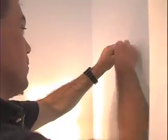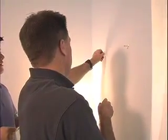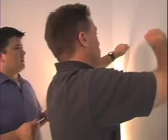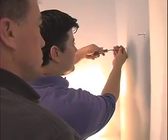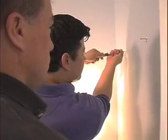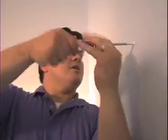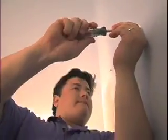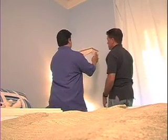The hole your screwdriver just came out of is the hole that'll accept the screws that will go into the wall. So you can kind of basically start that with your finger. And then go ahead and righty-tighty, start twisting those in. And you'll want to twist them until they're just almost completely in the wall, because we need enough room to latch onto the hooks that are on the shelf. So we just line those up? Line those up, and they should slide right on there.